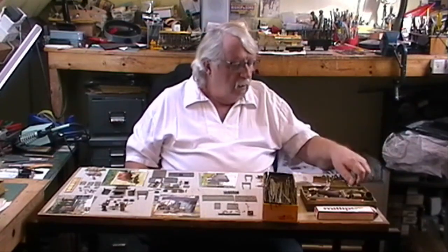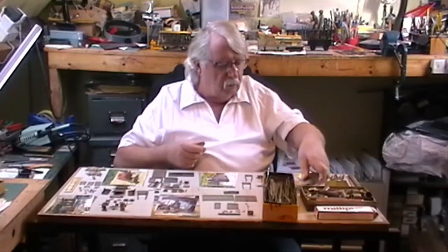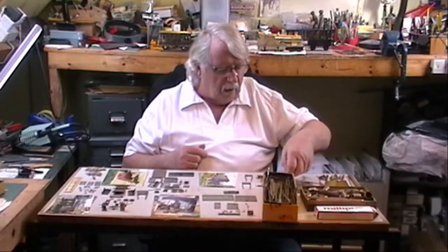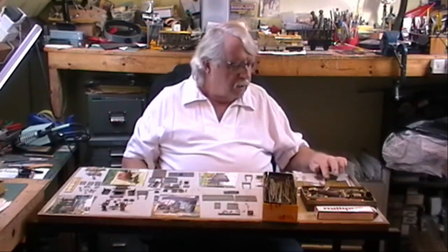We've also got a box of round bar for turnings, wheels and the like. We also use lumps of brass, brass rod. We also got to use thin brass and thick brass. We can also use nickel silver, just off cuts of nickel silver, lumps of white metal, because white metal can be shaped to make it a pattern, quite easy to work, and various lumps of little bits of bar, square rod and all the bits and pieces.